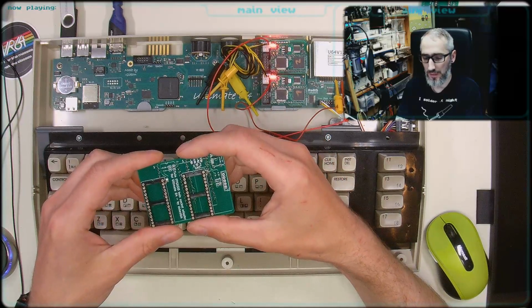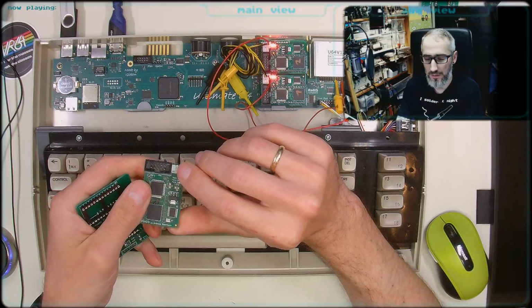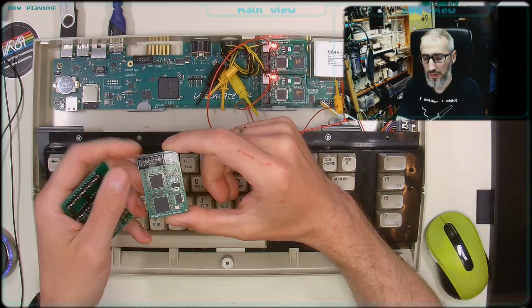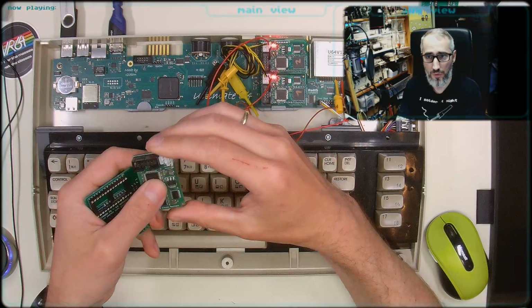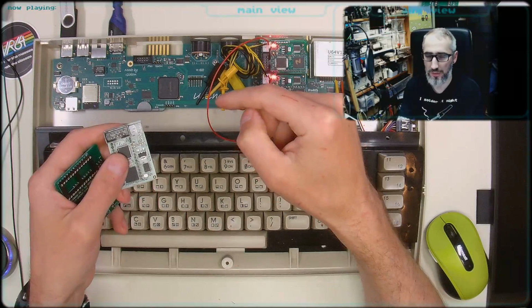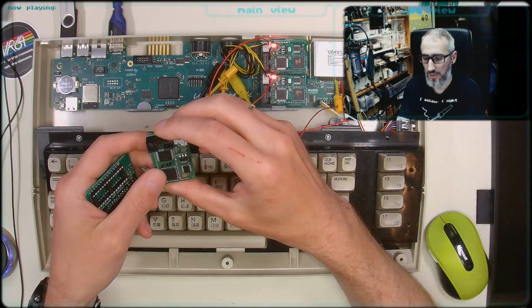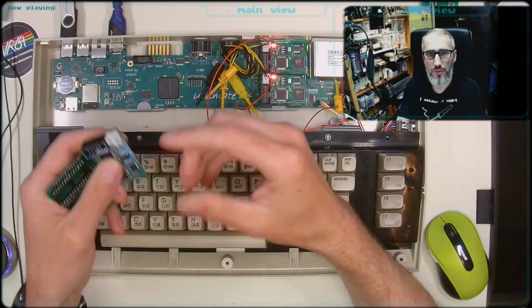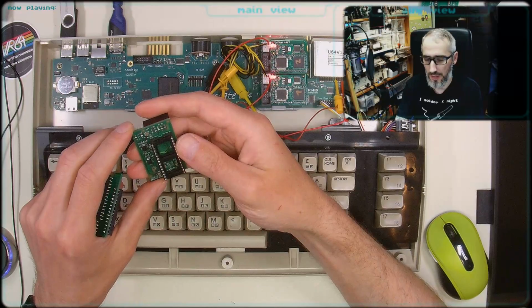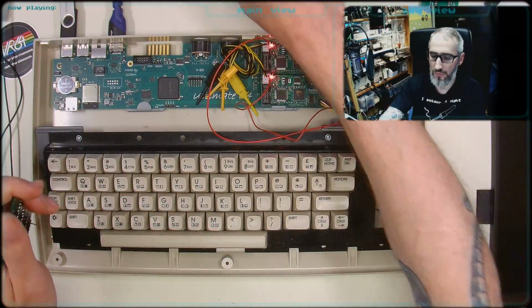And the FPGASID is doing basically the very same, but if you may remember, we have an additional port on the FPGASID. This is this 2-pin connector here in between those 2 bigger ones. And here we have access to a signal similar to the one the C64 outputs. And this signal can't be routed back to the board, because the board is expecting a different audio signal level. And therefore this is not working on the Ultimate 64, for example, and therefore we need access to an unamplified signal, and this is available on the production model as well as on the prototype, but it has a different location on the prototype, so we need to refer to the production model.